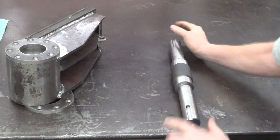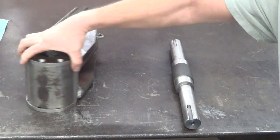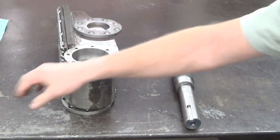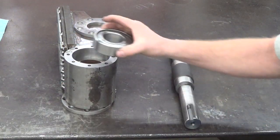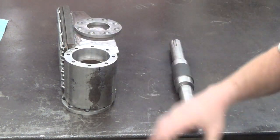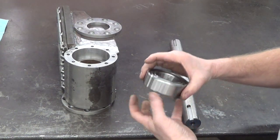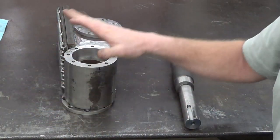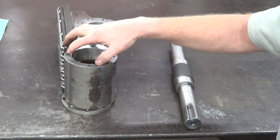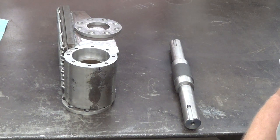The next thing I need to do is go ahead and assemble all of this. What I've discovered is that while I was welding this, I shrunk it slightly, so a bearing won't quite fall in on this side — it's going to be an interference fit. I've got one sitting in the freezer right now. This one here goes in the other side just perfect. So we're going to go ahead and use a propane torch to heat this up a little bit, and then we'll drop our bearing out of the freezer in there to make it fit perfect.